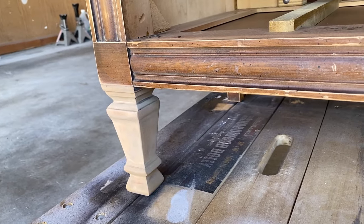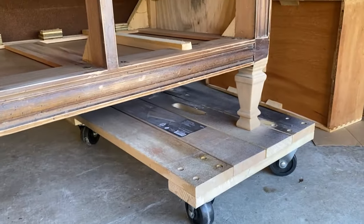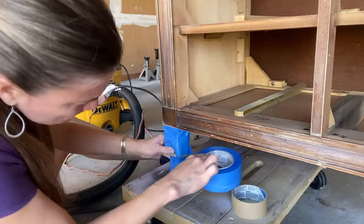Now that they're dried, you can see what they'll look like. In the course of about five minutes, I've changed my mind twice. I put that paint wash on the feet — I'm not crazy about them; they have more of a shade of a grayish green than I like, but I'm just going to leave them for now. I started to put a paint wash on the top, but as I feared, because I sprayed it with shellac, the wash wasn't adhering. I'm not going to sand it back down because I'm already dealing with the challenge of the feet being a different wood than the top. I think I'm just going to leave the feet raw and paint everything else.